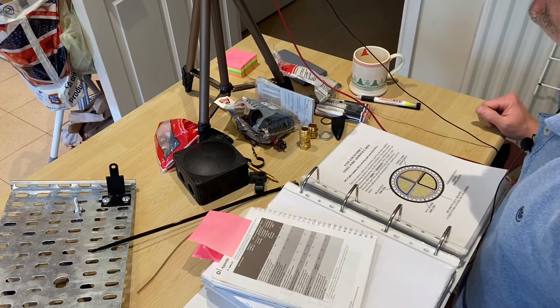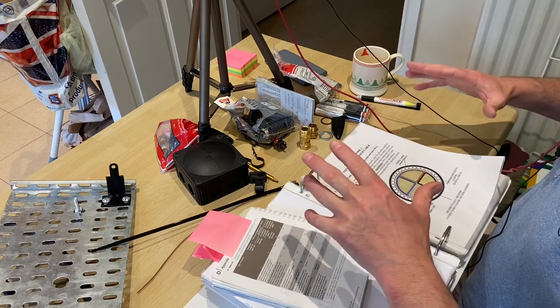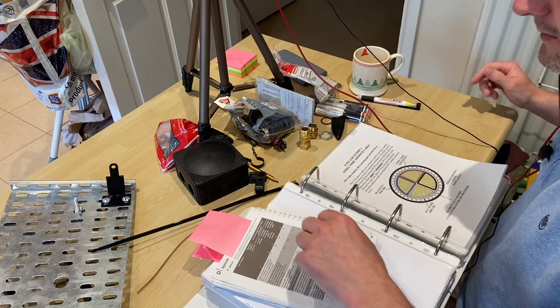More commonly we'd bury the cable going to a garage, summer house, or home office. How far into the ground? In the 18th edition there's no fixed rule - it says a sufficient depth, with 600mm recommended. So just over half a meter. Consider whether the ground is likely to be dug - for example at a caravan site, tent pegs hammered in for awnings. We're looking at about 0.6m or 600mm depth.